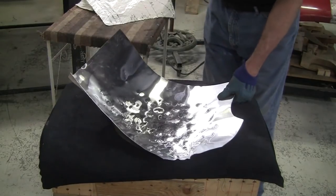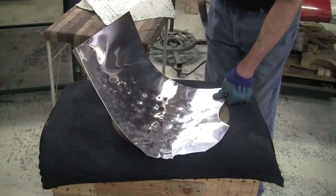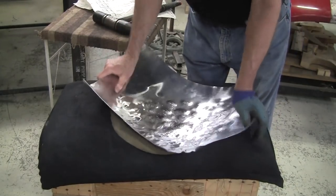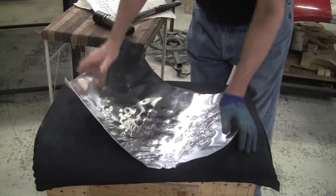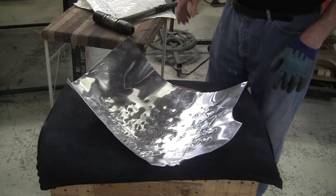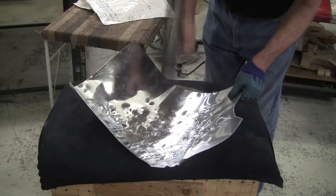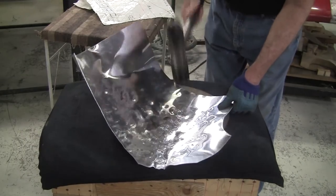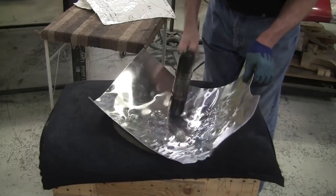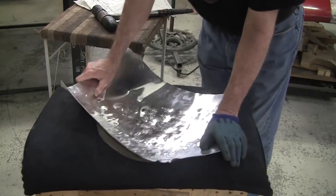Keep closing up — you have to keep opening it up. Every square inch of every panel has to be addressed somewhat. There's very little to say out on the corners here and a lot more generally in the center, but every square inch has to be dealt with whether it's English wheeled or hammered out like this. This aluminum is very malleable — they just keep moving.